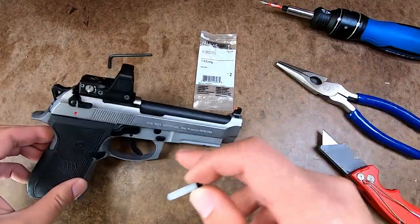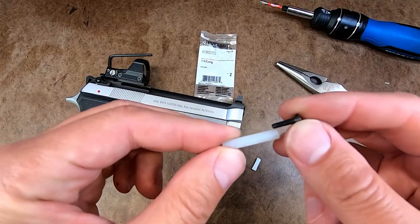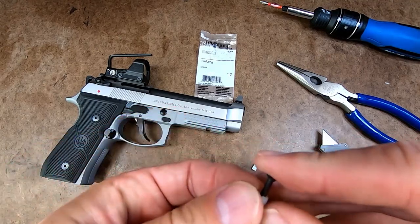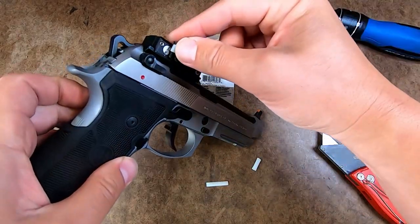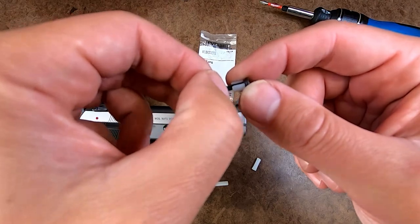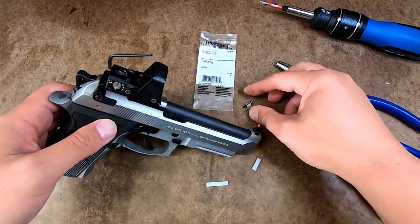So when I put it in here I had to get a snug fit. The threading will thread into the nylon because it's just plastic. And then because it's so short, this is basically what it'll look like — it'll thread into the plastic once it's compressed, and add a little bit of stability on the side-to-side movement. The bottom portion of this goes into the T-nut on the bottom of the plate. I just tested it with one screw, and it actually seems to be a lot more snug than without the spacer.